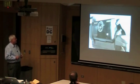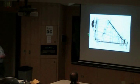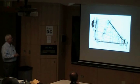Anyway, within that camera are a couple more freeforms. This is the taking lens I think I mentioned to somebody. This part's acrylic and this part is polycarbonate. That's a very sharp lens. It's corrected for everything except for axial color. The red image and the blue image are something like 3¼ millimeters apart. That doesn't affect the sharpness of the picture at all, so it was the right thing to do. Everything else is sharp about the picture, taken that way.